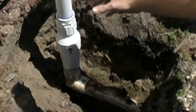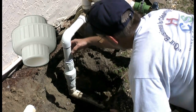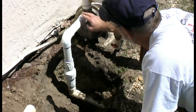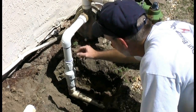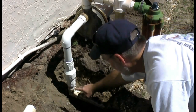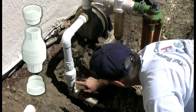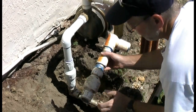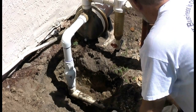So if this ever fails again, I figure I could have put a union in here. A union is where you can just unscrew it, which is maybe what I should have done now that I think about it. But it's not a huge deal to replace this piece. So in the future, I'll have to cut here, and then this should screw right out, and I'll still have my threaded fitting. The original one had a slip fitting, which is smooth — just a slide on with no threads. That's pretty much it.